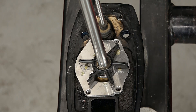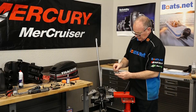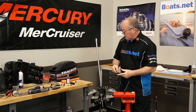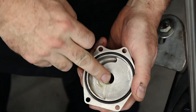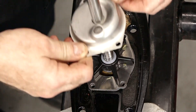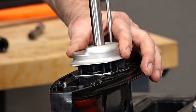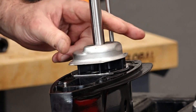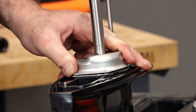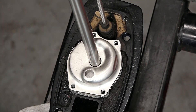Now here's where you put that second nylon washer in place. Get our O-ring and put it inside the housing. A little bit more grease inside of the housing, then we bring it down. We want to turn this clockwise as we push down. That way it'll be bending the actual ends of the impeller in the correct direction. So that's in place and it's pushed down.